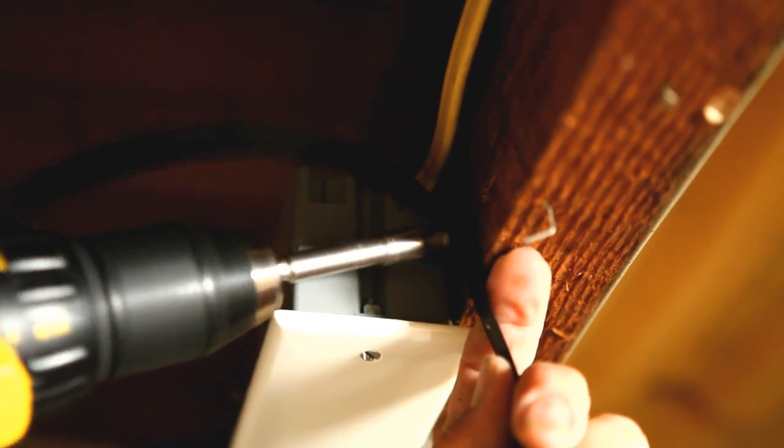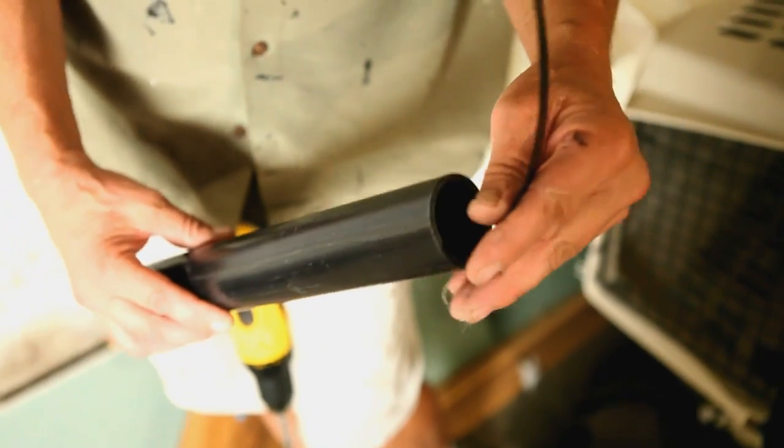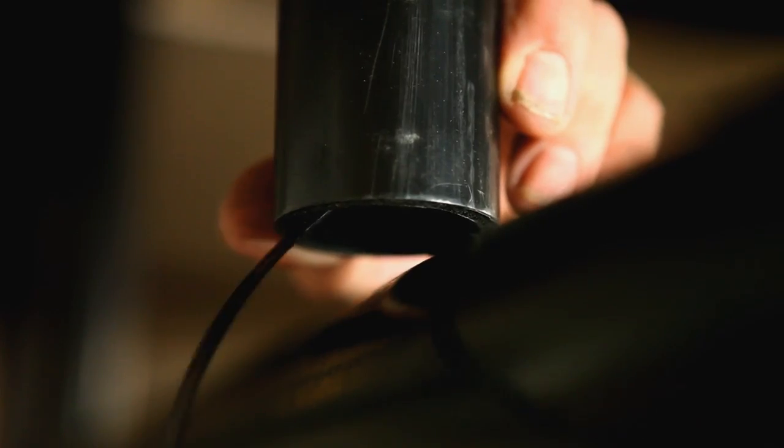And the way this works: he takes his plumber's tape and attaches it to the joisting, runs that down through the piece of pipe standoff, then around the drain line and back up through the standoff. Then he screws that to the joisting and goes to the next piece.